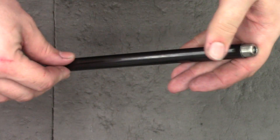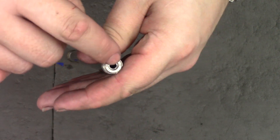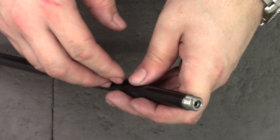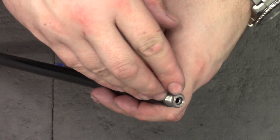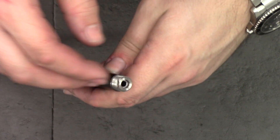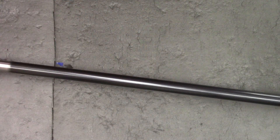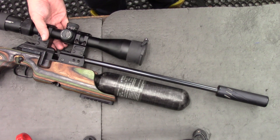I'm not sure how much difference the supports make but I feel with these barrels the weakness is the liner thinness — they wave about a bit too much for my liking, and the supports are a good compromise between having a solid barrel and having a removable liner. Right, I'll get a rifle, put it on and show you the final result.